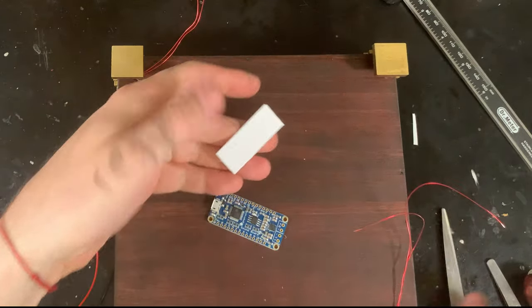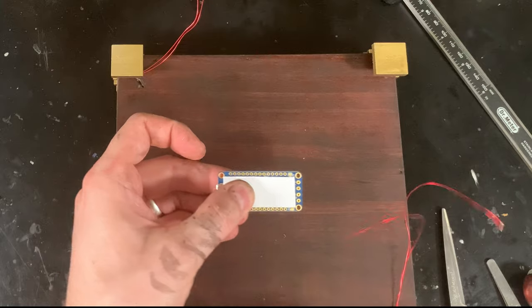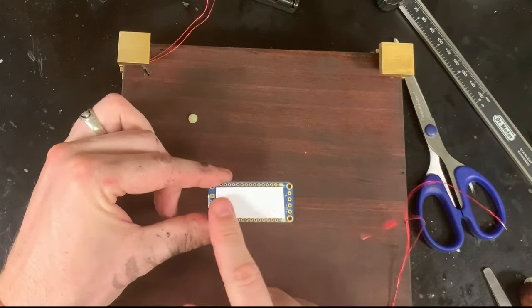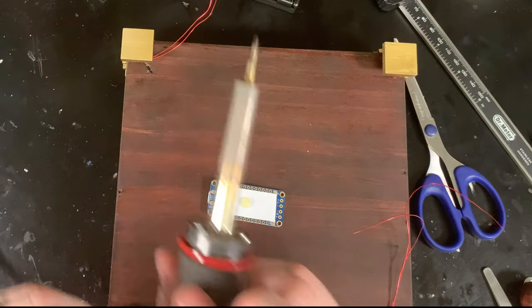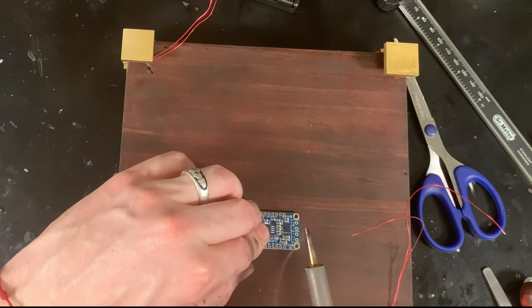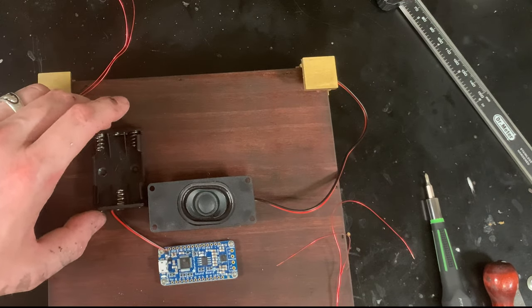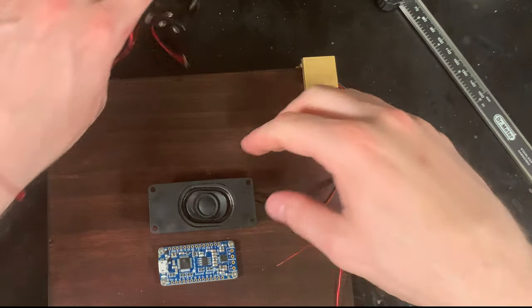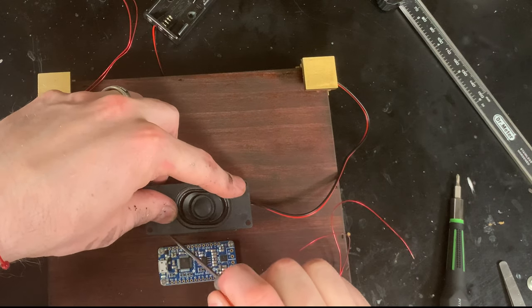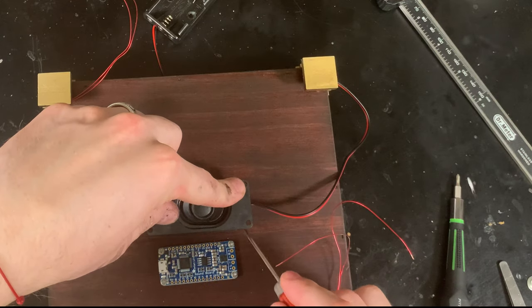I made a little PlastiCard offset to go underneath the board so I can still solder through to any of the pins, and it also lets me access the USB port so the board stays programmable after everything is glued in place. I attached this to the back with some sticky wax — it'll get epoxied on later. That brings us to layout: I have to figure out where every piece fits. Once I've figured that out I'll cut a hole for the speaker and recess it into the wood so it has a little more space to project sound before hitting the table.